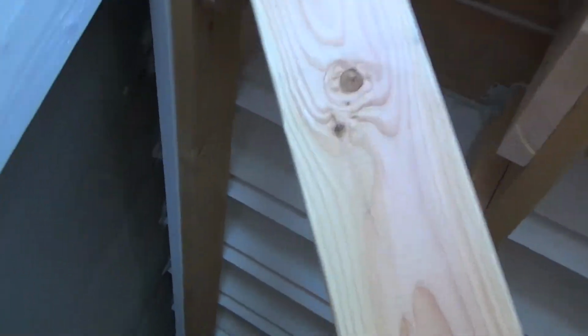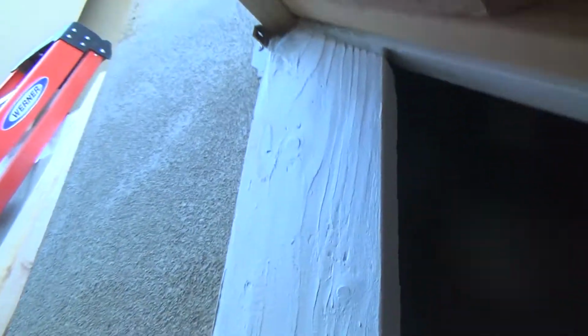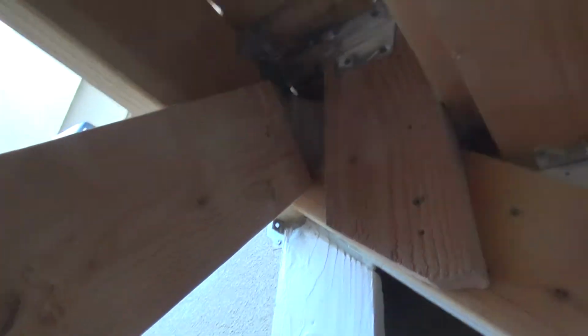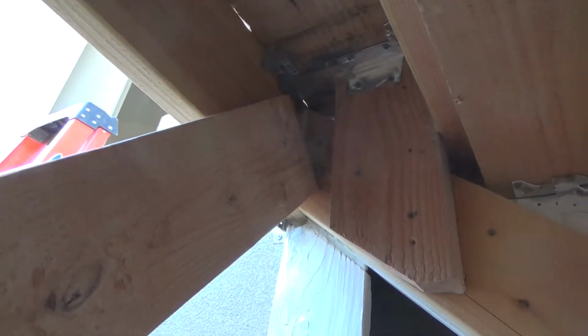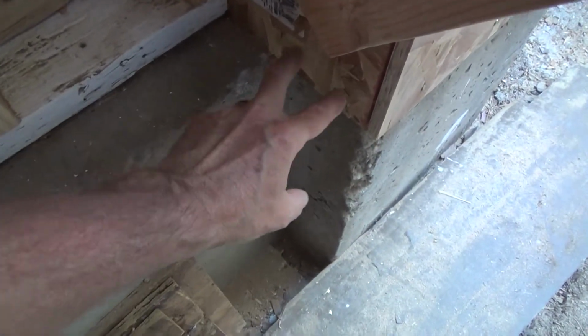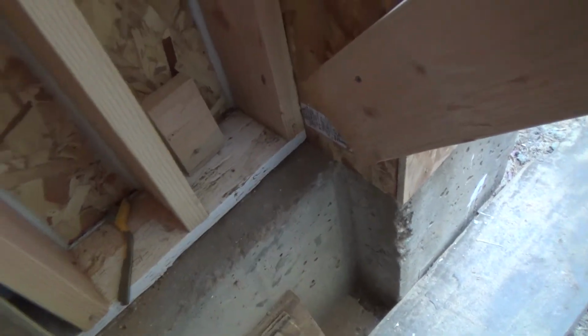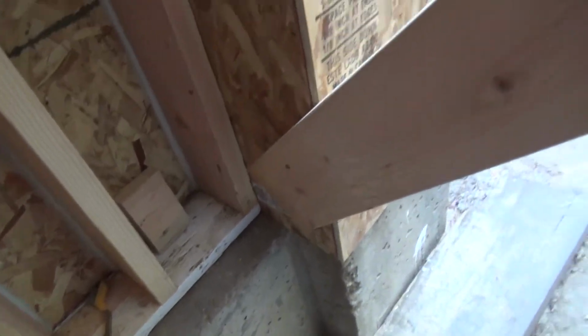Now could I leave that 2x6? That was that piece that really doesn't fit. Could I leave it like that and just put another screw here, one down there, and put a couple more screws up there and be done with it? Yeah, I probably could, you know. But going the extra bit and making it right is what I really want to do, and making it fit and really having this transfer the load down here. But in reality, we got the 2x6 behind here. It goes down, it's attached to the bottom plate. The bottom plate is bolted down to the concrete footing or the stem wall and this section right here. And so that's really close enough, but I would feel so much better to set it actually down on here like it's supposed to. Okay, you decide.